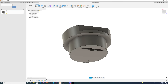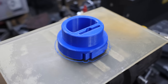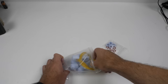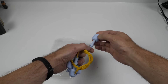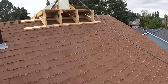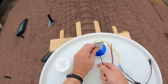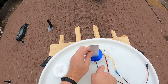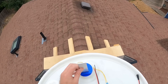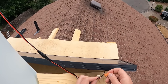This part is a perfect application for a basic 3D printer — the dimensions aren't critical, and because it's just supporting a switch, it doesn't need to be watertight. These float switches came in a bulk bag off Amazon, which is good because we'll be maxing out their current limit and may need to add a relay if they start burning up. I did cheat a bit by drilling and tapping for a set screw after the 3D print was done, but that's common practice for any feature that needs a precise fit, even with expensive industrial 3D printers.